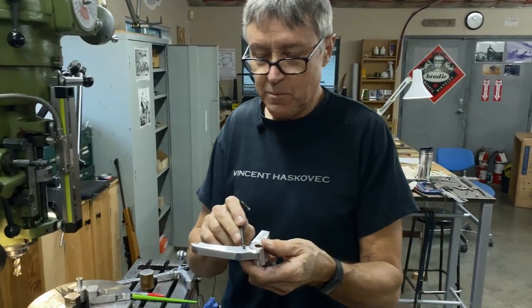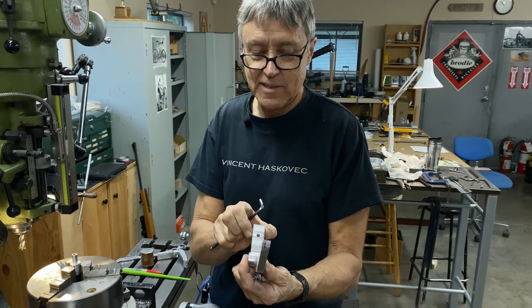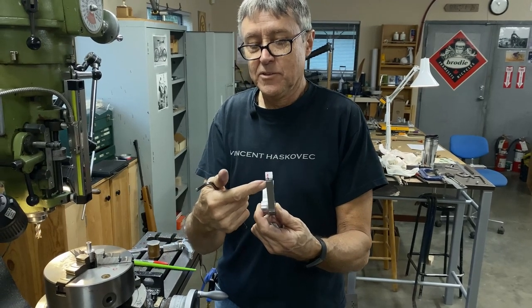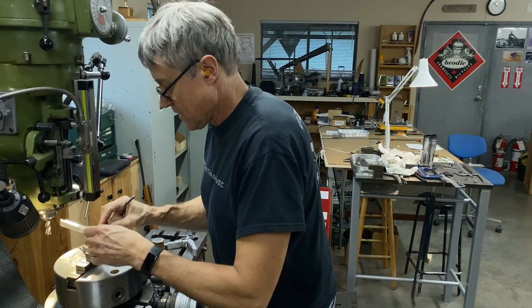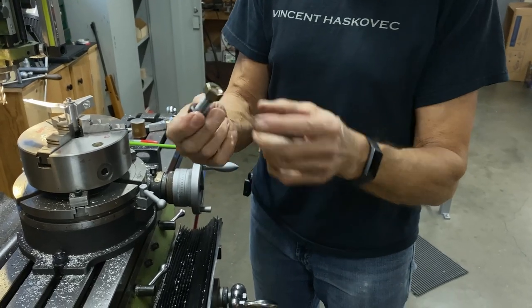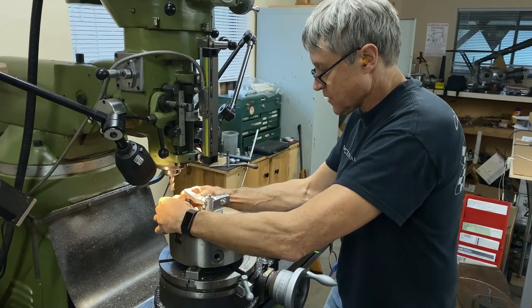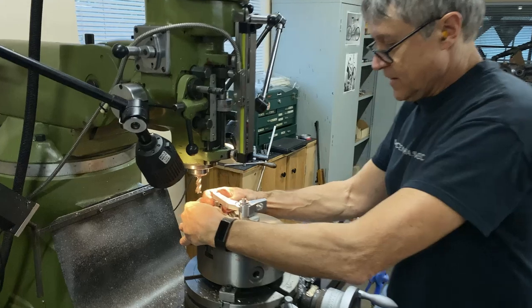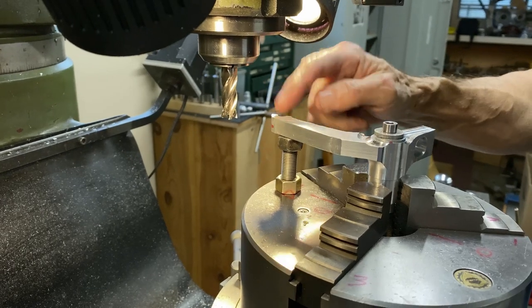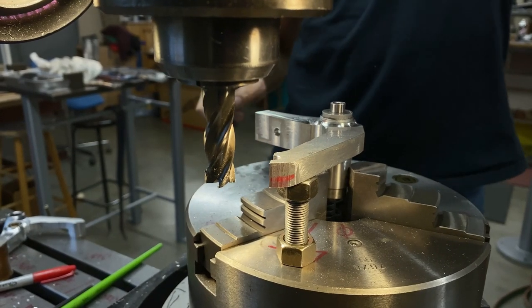We have to mill this down, but this section is a lot longer and not as thick, so it's probably going to vibrate. I'm going to put a little jack under here. All it is is a piece of ready rod with a nut welded on — I found this in my box. It goes under like that and supports it. I just use my hands to put a little pressure on there so it's not going to vibrate. Then put some cutting oil on there — it's not lubricating oil, it's cutting oil.